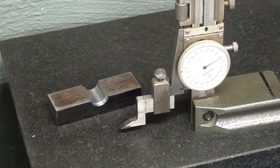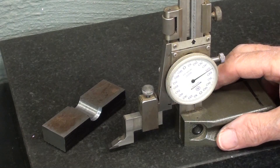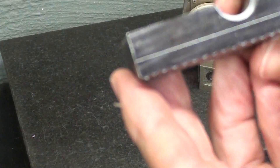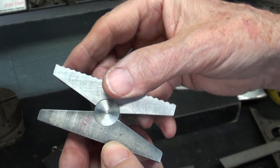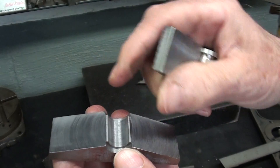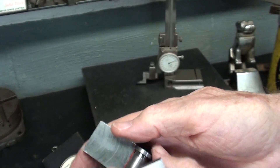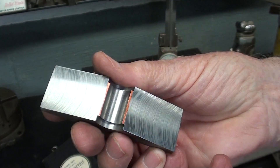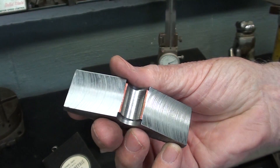Let me show you how to do it with the protractor. I already have some dye on there, the height gauge is set for one-fourth of an inch, and I've scribed that line. This is what it looks like when it's finished and assembled. Notice on the one I made there is a little flat here that was never machined. I put some red dye on this one to show you — I'm just machining up to that — and the red part is approximately one-sixteenth of an inch.